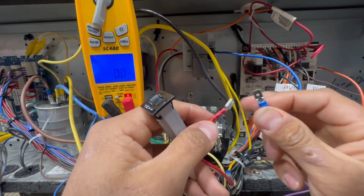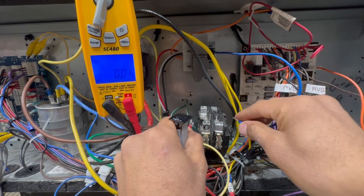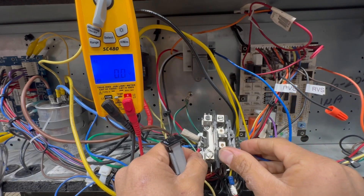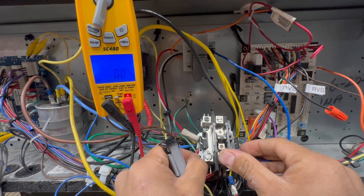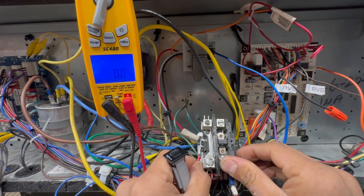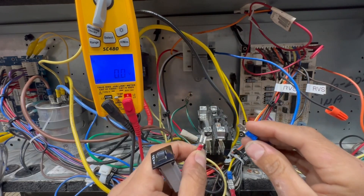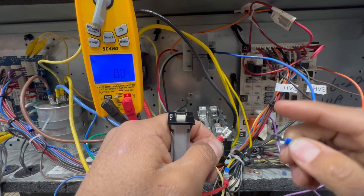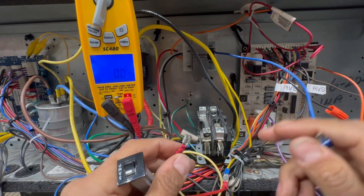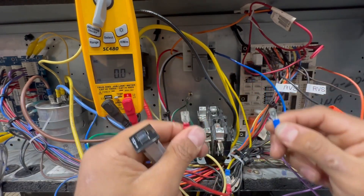The way I like to think of these: these are two gang members. These two gangs don't like each other — they're going to fight. But if they go to a gang rehabilitation program, they can now work together. Those 24 volts are then sending current back and forth, engaging that coil to push down, pushing the contacts down. They're working together because they're going to a load. But if they touch each other before reaching a load, they pop that fuse. These two must go to a load — that applies to the contactor coil, the thermostat, the solenoid valve, anything that takes 24 volts.